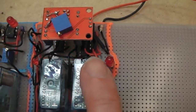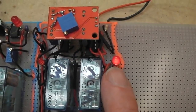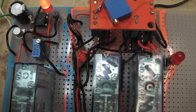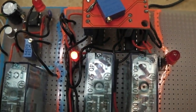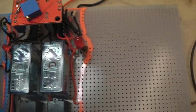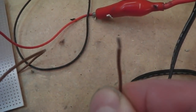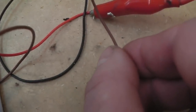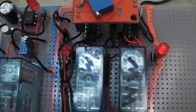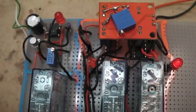So you're washing the screen and wiping. It waits, wash and wipe again for a little bit longer this time. And then after it's done, this is post wipe's going to be next. Post wipe. Then resets the whole system, and it's off until I re-trigger it with this, which would be my foot pedal switch. Do it again. Foot pedal switch goes on. 12 volts. System becomes active. Wash and wipe. Wait. Wash and wipe for a bit longer.